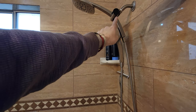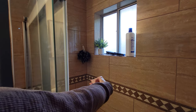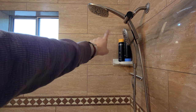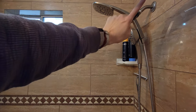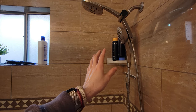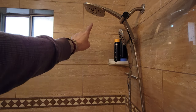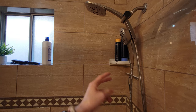Highly recommend removing that water restrictor — the pressure is insane. The supplemental head was spraying pretty hard all the way across the shower, about six feet. If you want to keep the restrictor on, it'll save water, but with two showerheads you're going to need more pressure or it'll just dribble out. Removing the restrictor is night and day. This isn't a perfect video — I'm an average consumer that just took some time to install this. If you enjoyed it, please like and subscribe. This was on sale at Costco for $75, normally $99. Hope you all have a great day!